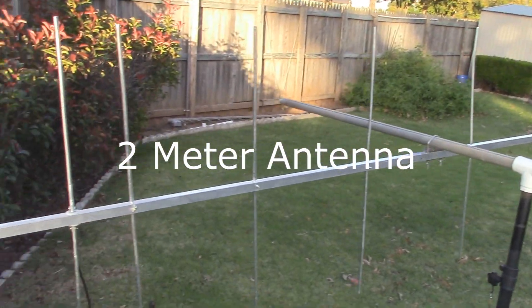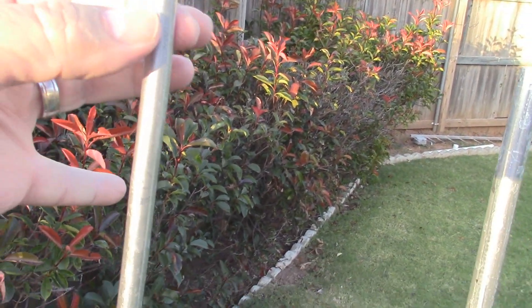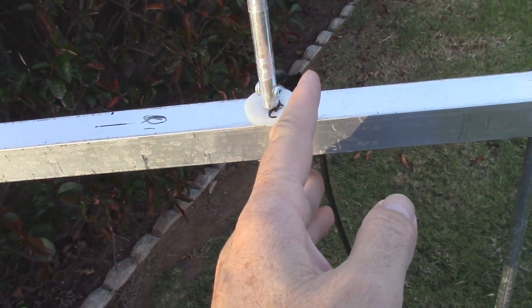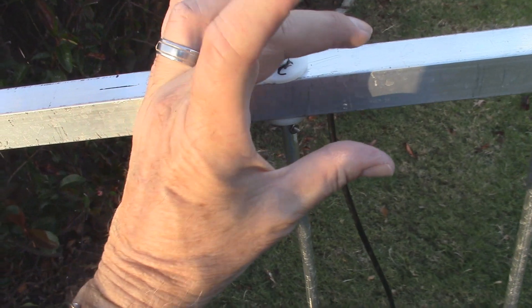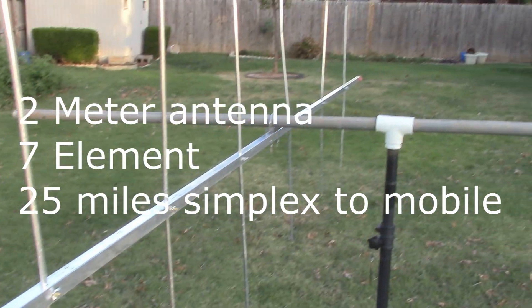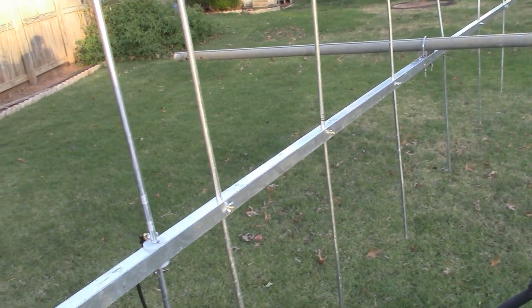Here's the finished product. Signals are coming over 10 over S9. What I've been doing is cutting a little bit off, maybe a quarter inch with my tube cutters. I think I need a mount where I could slide the driven element back and forth to get the SWR down a little more — maybe a slotted area. But all in all, I did work this antenna three feet off the ground, making contacts about 20 to 25 miles out, and I was tickled to death about that. They said I was coming in pretty good. This is a K7MEM design.